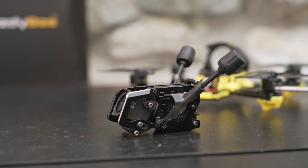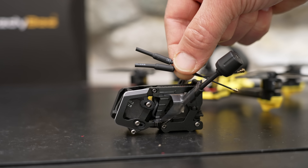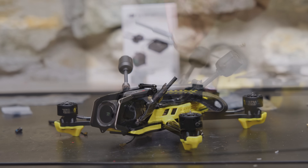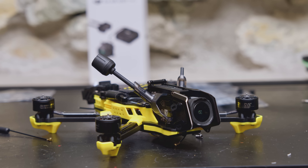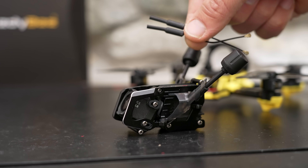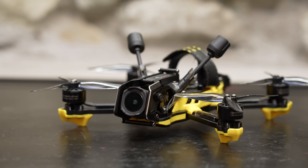I am a little bit worried about the durability of these plastic pieces because in a crash the antennas will act as levers and put pressure on them, and they could break. I did test fit whip antennas like the ones the B25 uses, which would be much more durable, but in the end I decided I wanted the better range from the original DJI antennas. If you plan to fly this drone hard or do a lot of freestyle, you might want to use whip antennas. It's a trade-off between better reception or better durability, so it just depends on which you prioritize.